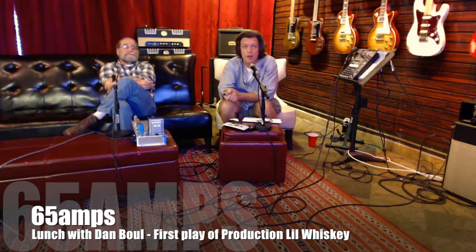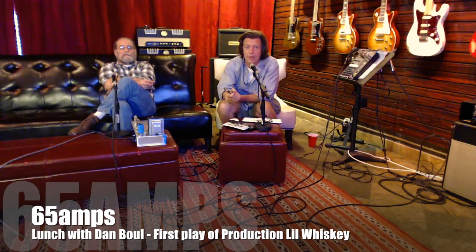Willie says, so if my amp seems less bright, it could be aging EL84s. Totally. How many hours are on it, Willie? Less bright, less distinct, less punchy, less everything. There's bad news and good news about 84s. The bad news is they're not long life tubes. The good news is they're cheap. So, you don't get your cake and eat it too in the tube world ever.